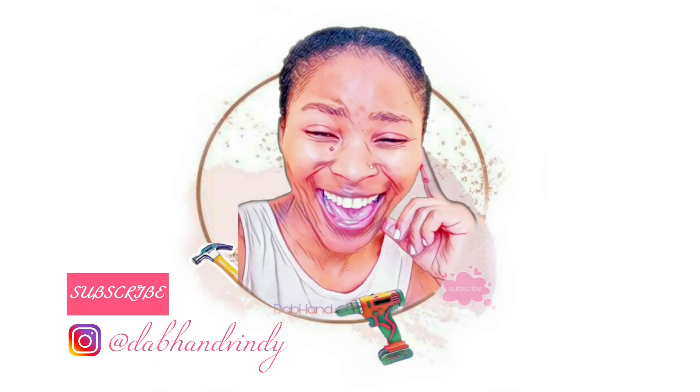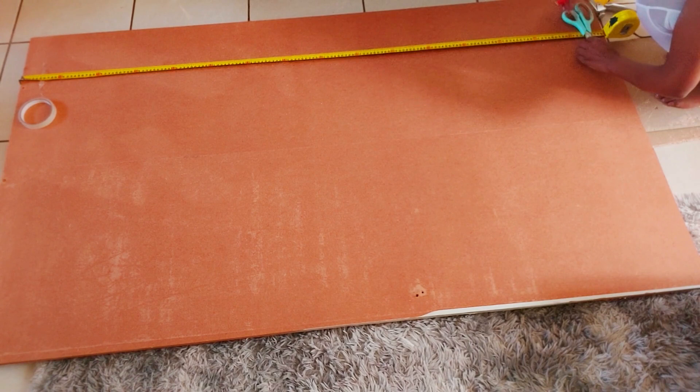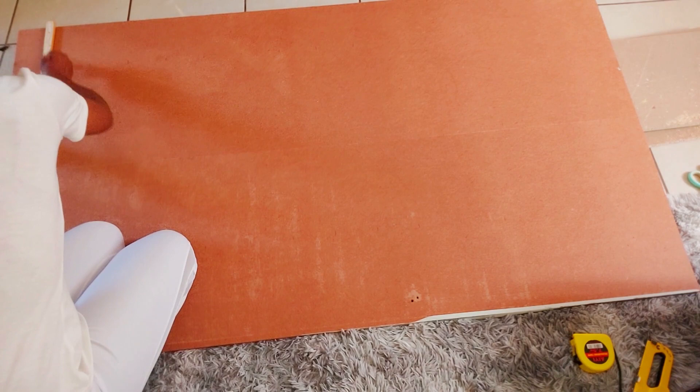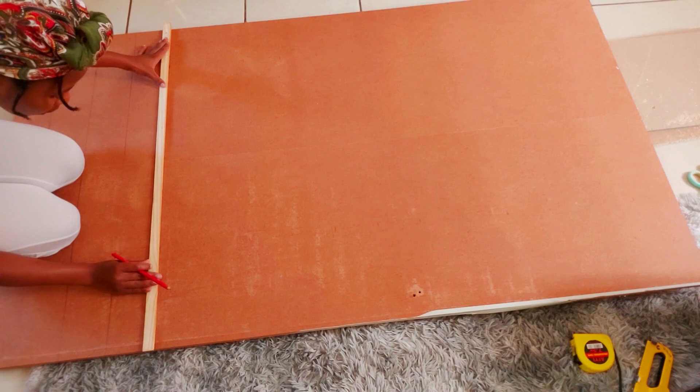So that's what I'm going to make today. I'm doing this for a queen size bedroom, so 160 centimeters is good enough. If you want to make your own headboard just like I did, you need to follow the steps. Mark your board and draw lines on every 10 centimeter mark as a guide for your cardboard strips. I divided the length of the board, which is 160, by 10 centimeters — you get 16 channels in total. Now I'm finally using that algebra.